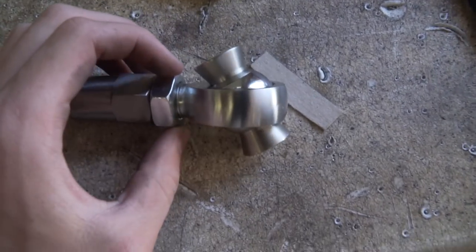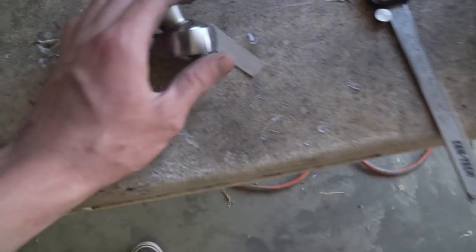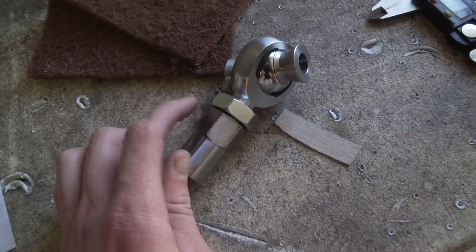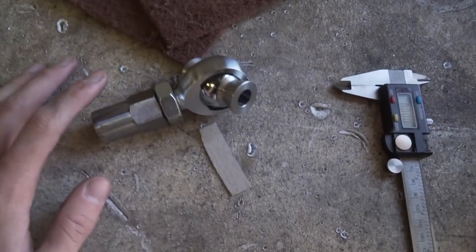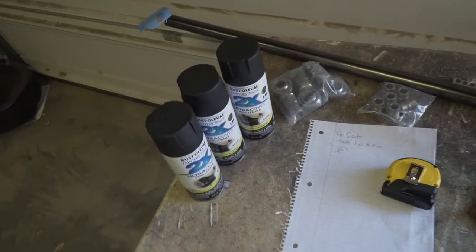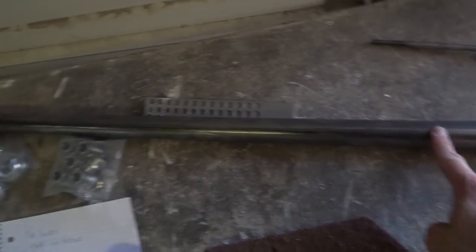It's been a few days since I filmed any clips because I was waiting for parts, but they're finally here so I can get the front of the car all back together. Starting off we have some Rough Stuff heims - these are three-quarter inch heims with a misalignment to accept a half-inch bolt, stainless misalignments. You can get them in stainless or zinc; I went a little nicer with stainless. These heims are a little lower on the quality spectrum - I'll link a video in the description if you want to learn more about them, but they'll work fine for our application. Over here I have some paint for the tie rods, and I'm also painting the gas tank. Here's the rest of the heims and misalignments, and here's our tubing for the tie rod - inch and a quarter, 120 wall. So the 120 is your wall thickness, basically an eighth inch, giving a one-inch inner diameter.